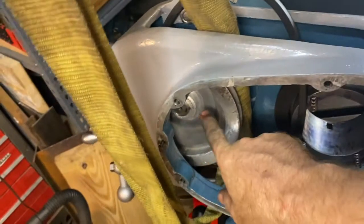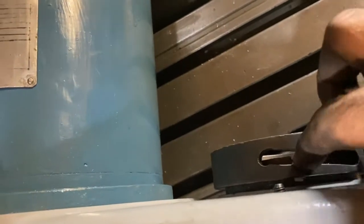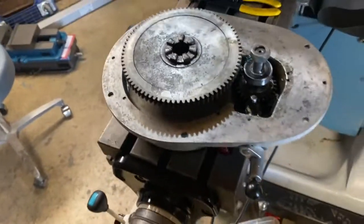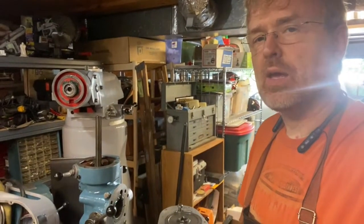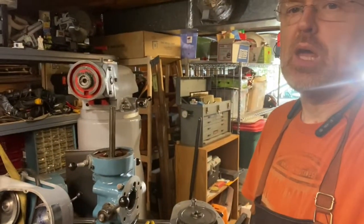So to summarize: motor to pulley. The pulley is on — I think they call it a spindle sleeve — that slides up and down based on this rotating and pulling where those screws go through into that sleeve. As it rotates it'll pull it up and down. That then moves this part up and down, which then adjusts the shaft, which then makes the connection. And that's Bob's your uncle, I guess. Alright guys, I hope that helped — a brief overview of that J-Head. There are some good YouTube videos from H&W Machine where they do more disassembly, but I don't think that they went into the detail I had on this. Appreciate it, thanks, bye.